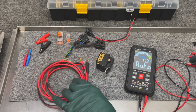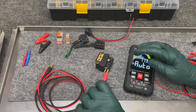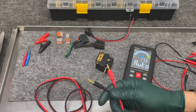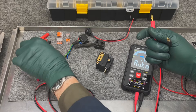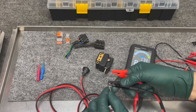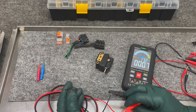When we get into other testing I use this probe — it's six feet long with banana plug tips on both ends. I can remove the standard lead and plug this in. Now I've got a very long lead but without the sharp points. Let's check continuity — yes, we have continuity. I also have larger alligator clips for grabbing onto bigger wires. For example, if I want to check whether a switch works I'll clamp one here and one here, and test the switch: off, on, off, on.